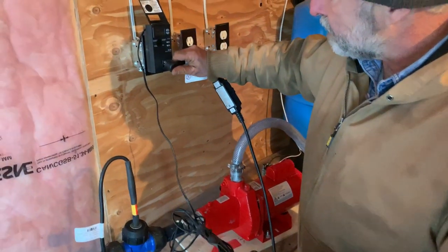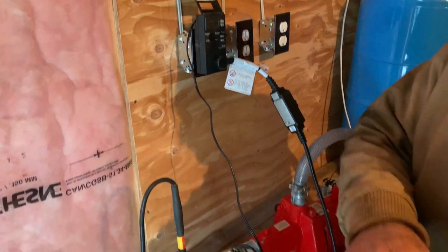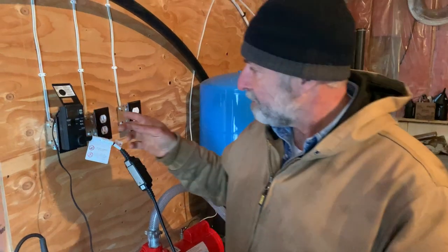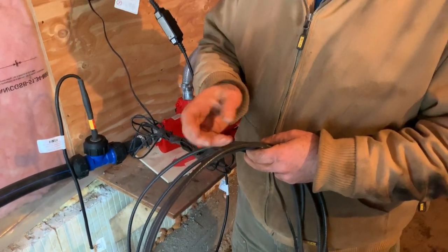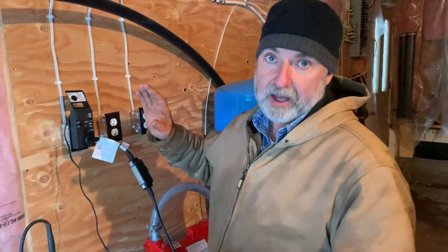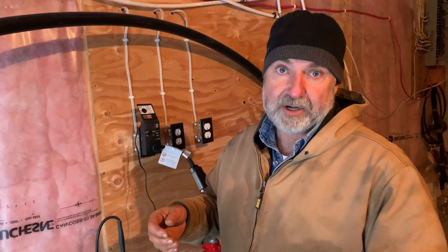The system is really quite simple — it just plugs in here. The thermostat will turn the cable on when heat is necessary and shut it off again when heat is not necessary. That function, coupled with the fact that this cable is pretty smart, means the system does not use very much electricity at all. The cable is self-regulating — it can apply more or less heat along its length depending on the temperature right there. Coupled with the thermostat, it really uses the bare minimum of electricity. You might not even notice it on your hydro bill.